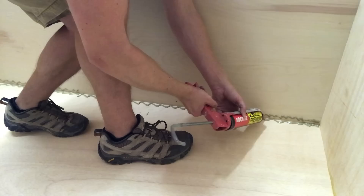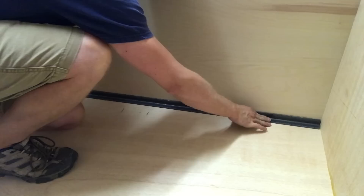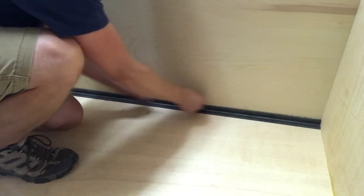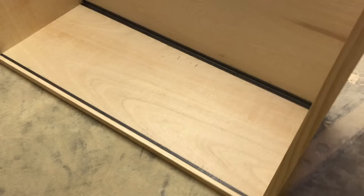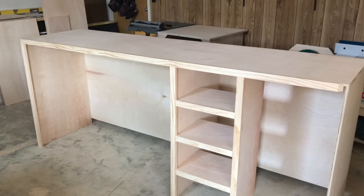When the sections were cut, I took them inside and wiped them with a cloth to remove rust and steel dust — you want clean surfaces. I flipped my cabinet over to get at the underside and used gravity to my advantage. Then I cut an angled nib on the adhesive tube, punctured the seal, and loaded it into my caulking gun. Dispensing is easy: you want about a quarter-inch bead, and if you can, run it in a little zigzag pattern to help it spread more evenly. I coated every surface the metal would touch, then pressed the angled steel into the adhesive bed and shimmied it back and forth to flatten the adhesive and form a pressure seal. When both pieces were embedded, that was really it — I left it upside down in a flat place for a couple of days to really dry and bond.